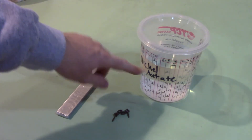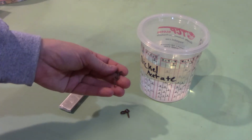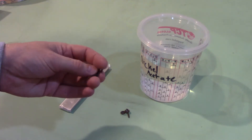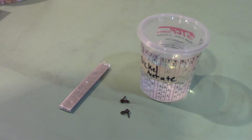This container is filled up with vinegar. I'm going to get the two nickel rods and pass a current through the vinegar, and hopefully that'll turn into nickel acetate. Some people in the videos will put a little bit of salt in there - I'm gonna try it without it first. If it doesn't work, we'll put a little bit of salt in. But also at the same time, I'm going to try to get the rust off of these parts. They're too small to sand, so I have some phosphoric acid mixed 50% with water. We'll put that in there and hopefully the rust will come off, and then we'll try to plate it. So we'll start making our nickel acetate solution right now.